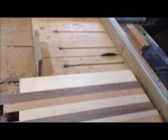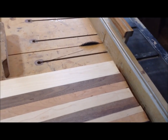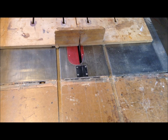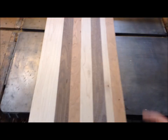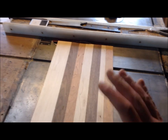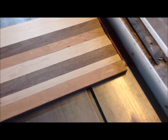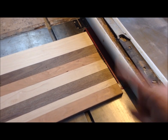I'm probably going to use my fence to cut all those slats, but I'll check to see if my cross-cutting sled is square first. The fence is going to be my best bet. This is not the safest cut when you have a large cantilevered piece, but I cut plywood like this all the time. You just want to make sure you're not twisting it in any way, and you definitely don't want to use the miter gauge in conjunction with the fence. I have a good push stick and I'm going to slide it through.